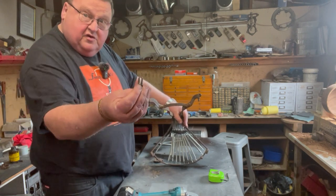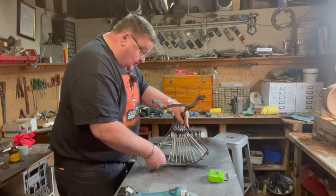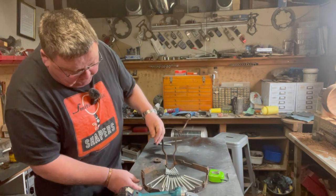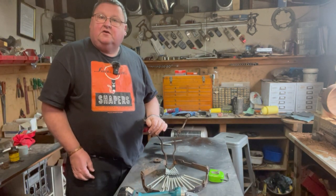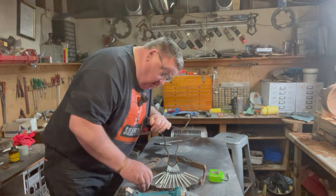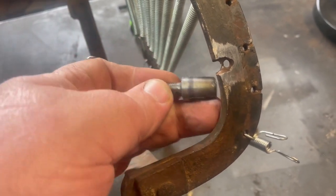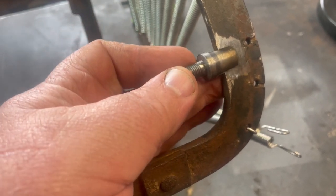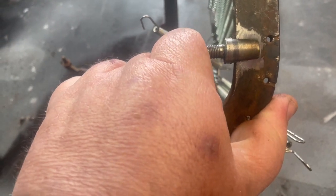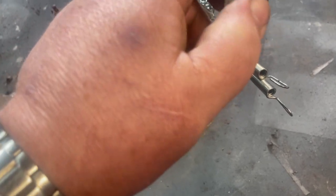I'm back — I've had a good result. I've widened out the slot in the little piece and now it fits. I've released three springs and given it all a little tidy up with the grinder, and it all actually fits. Before I zap this with the welder I'll get you off the tripod for a look. Here's the little piece I've made — there's the original slot, I'm almost in the middle. That will just slide over there and I'm just at the bottom of my mark. A little tap with a persuader and we'd be ready to zap it.